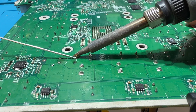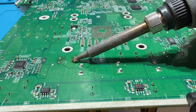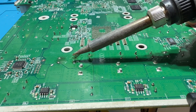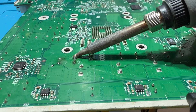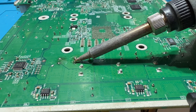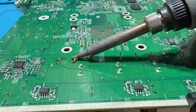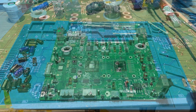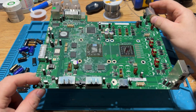We're gonna go ahead and get these removed. I'll just do one on camera. I have low melt solder here — chip quick. There we go — there's one. I'll do the rest off-camera. Got all the caps removed; they came out without any trouble.